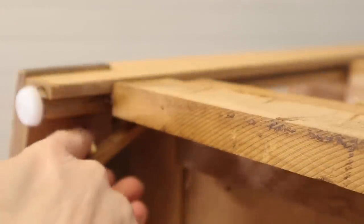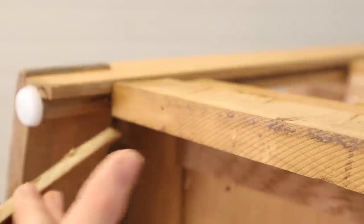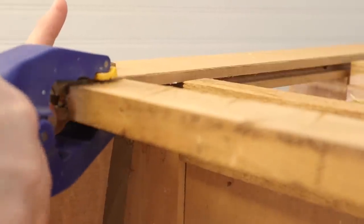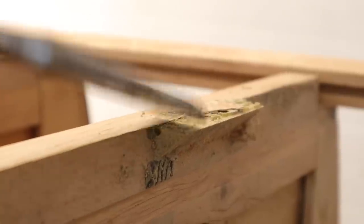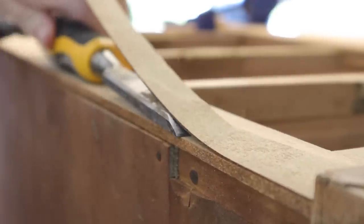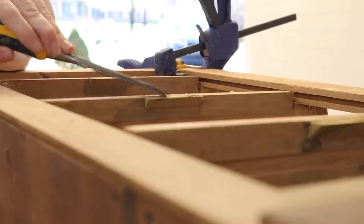Because we are missing some pieces of veneer — I am not a furniture restorer per se; I do restore some pieces and I like to restore solid pieces. I don't replace veneer very often, so I don't have a bunch of veneer here. I'm not going to run out and buy a bunch of veneer — it can be kind of expensive. I'm going to be making the repairs on the front with Bondo, painting parts of it, and staining the rest.